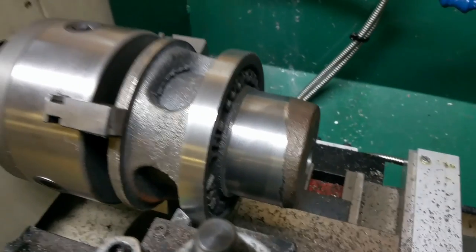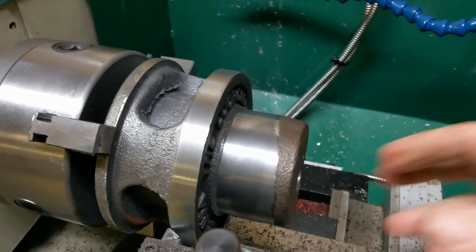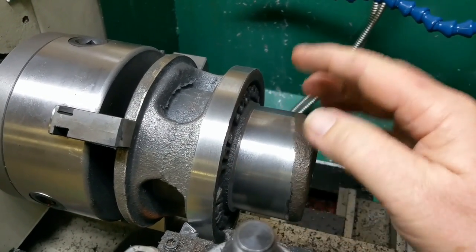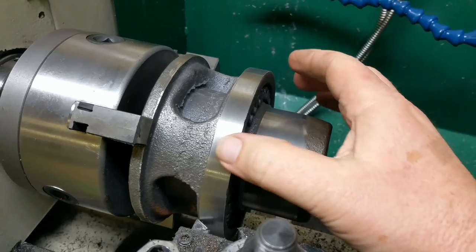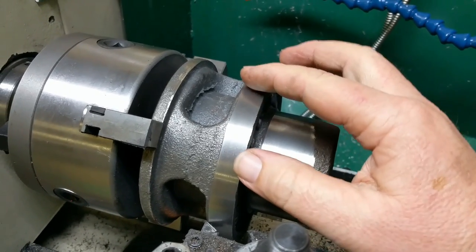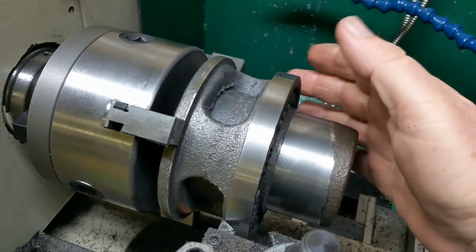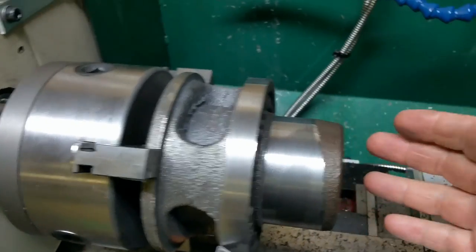What I had to do is turn this rough casting down to where I can grab it with the four-jaw chuck — grab it here — and I needed a smooth spot to indicate here. This is also freaking rough. There's no way I could run an indicator on there and get it where it's going to run true.